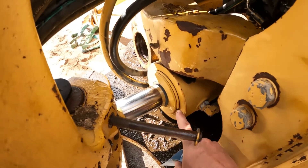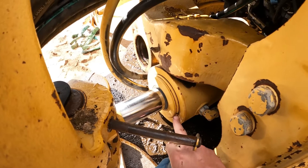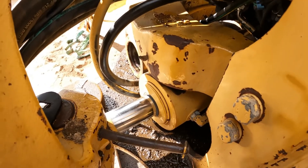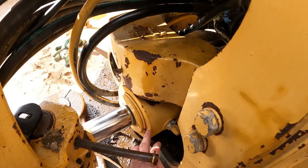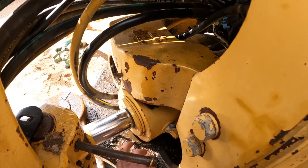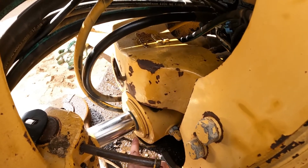You'll start by taking this ring - you'll have a little split right here and you'll spread that split until you can pop the ring off. Once the ring is off, you can drive this center portion in. Just be careful not to gouge the inside of the barrel walls, but drive it in far enough past the groove.